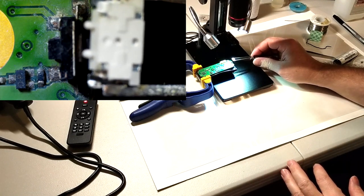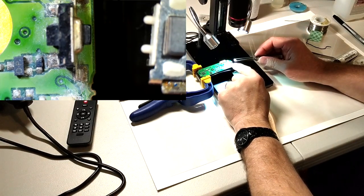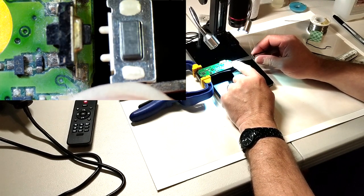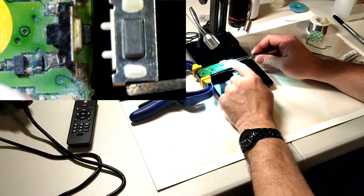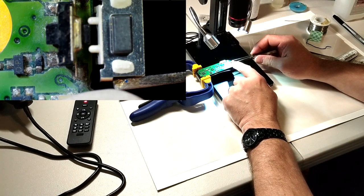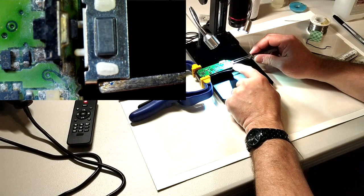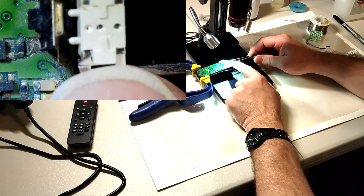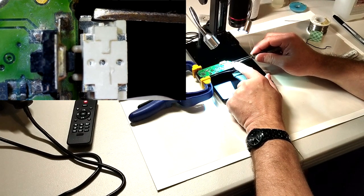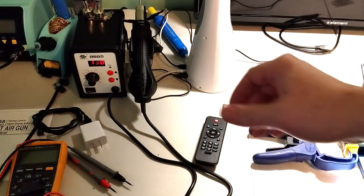So this is the switch I picked out to try to replace this one. I don't think they make a switch just like the switch on this version 5 any longer. This switch here is very similar to the version 3 switch, the version 3 board. I am going to have to break the little plastic tabs off the bottom, but the way the metal frame solders on the board to hold it in place, and just for rigidity, and the way the contact points on the back line up, very, very close. So we'll see if we have any luck with it.